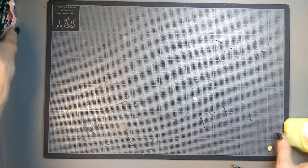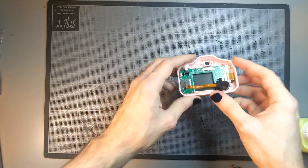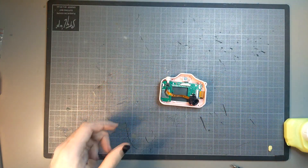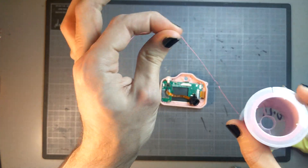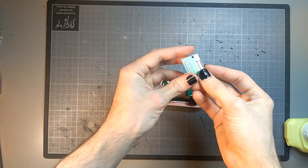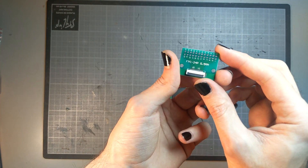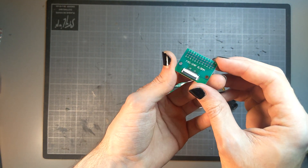So if we look inside — normally if you want to circuit bend this, you will have to solder a really tiny copper wire to the pins here. Copper wire like this one, which is really really thin. But you have to do this only if you are good at soldering, which I'm not. So I found online those little adapter boards that snap onto the ribbon cable here, and get them through regular pins that I'm able to solder with my clumsy goblin hands.